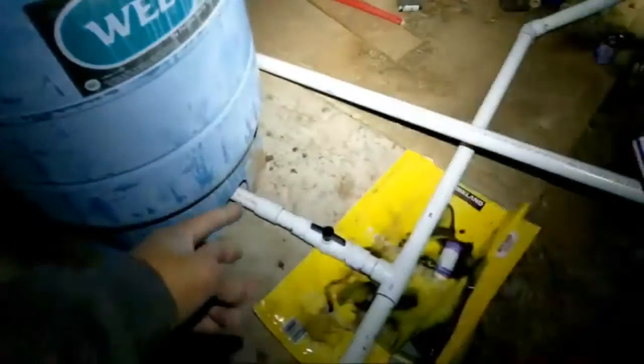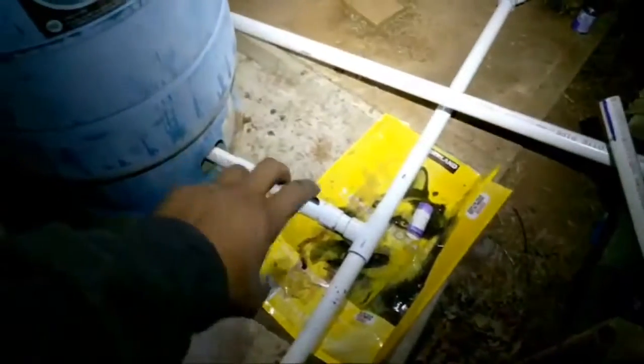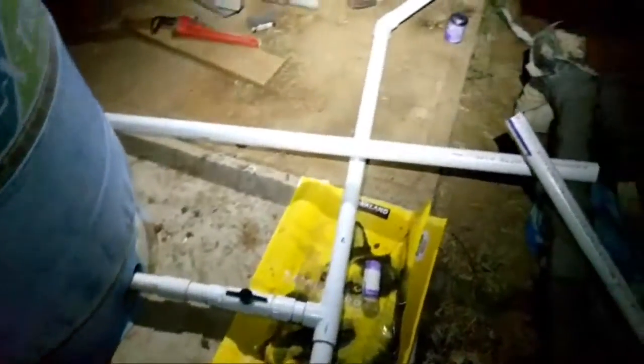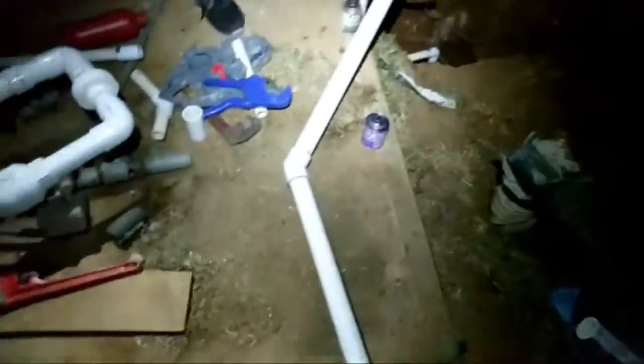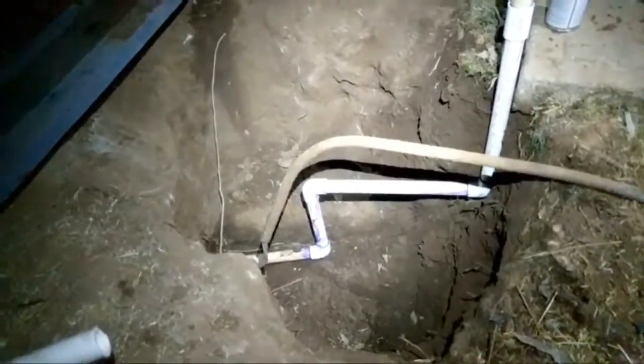We did the same thing after a little bit of struggle here. We have some more room so we can cut it and then add the slip repair, but we have the turn off valve on this one as well. Sorry, this pipe isn't connected. This is then running to the main. We have the main going as a step down. So we have the step down dropping about 18 inches, and then it drops down to about 24 inches. And then that then leads to the house.